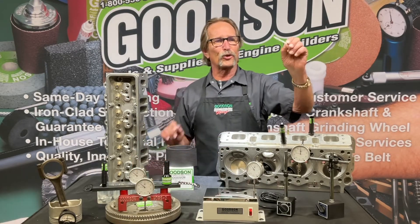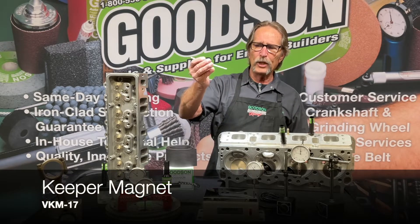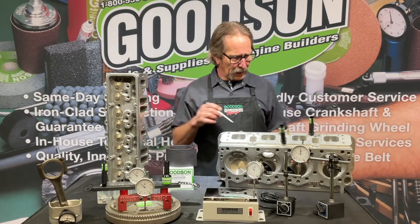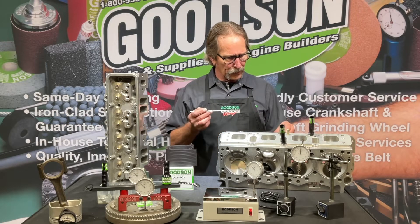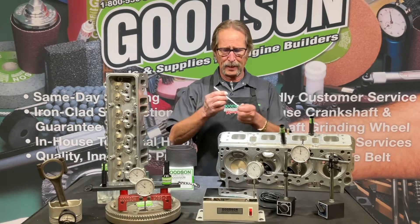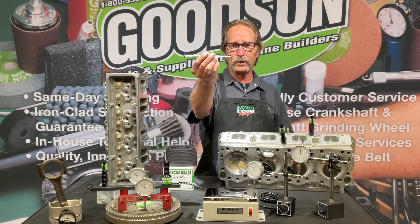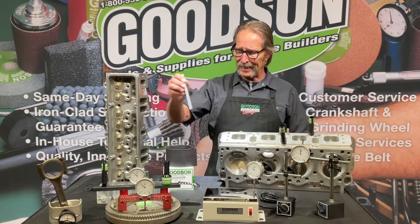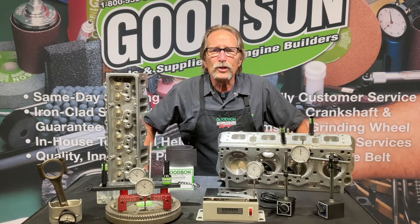You've seen me use this little straw magnet before — rare earth magnets there as well. We use that mostly for the keepers in our multi-valve overhead cam cylinder heads, or even big top fuel dragsters which fall into the same thing. They have keepers and little bitty nuts, bolts, and washers. As you can see, we can reach right in and grab — it's got it on both ends. So you can have one on that end, put it on that end, and you've got two keepers in one. That's our VKM 17 — a nice, clever little straw magnet to make it easier in the machine shop.